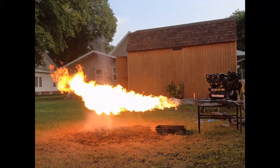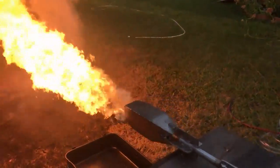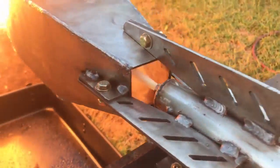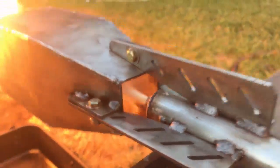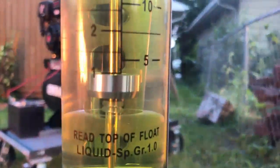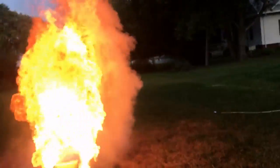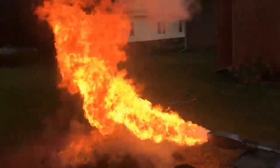This is actually 2.3 megawatts because that's the lowest read we have on the meter. Look at that spray of fuel just blasting in there — that's like a concentric nozzle. We're right at about a gallon a minute there. I'm going all the way up to 3.6 megawatts.